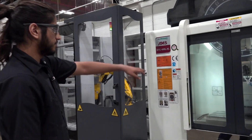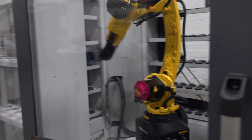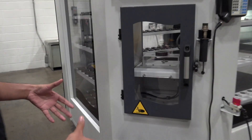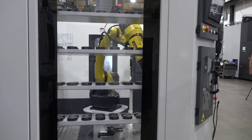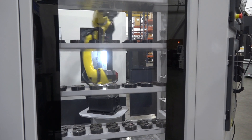While the machine is running it will take the finished part that it just did and hand it to what they call the WSS. This is where you actually interface with the cell — an operator would be here loading and removing fixtures. Once the robot clears and the shutter closes, you can open the door without it alarming out.